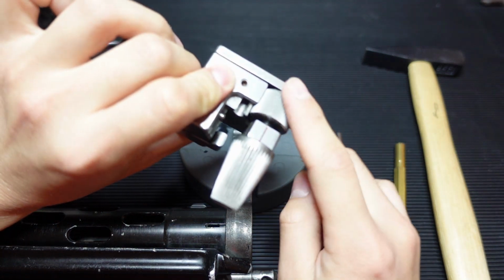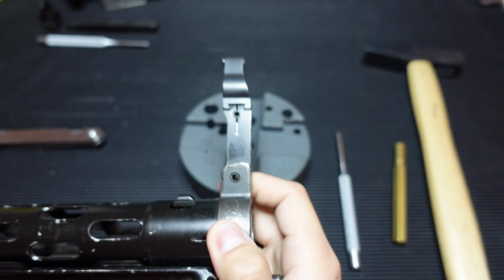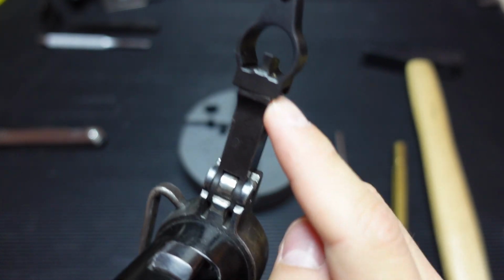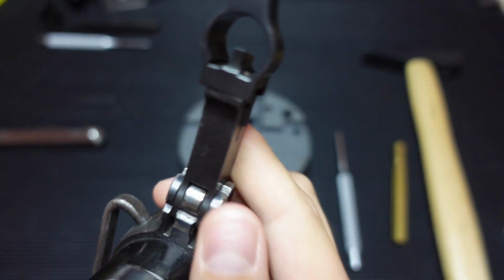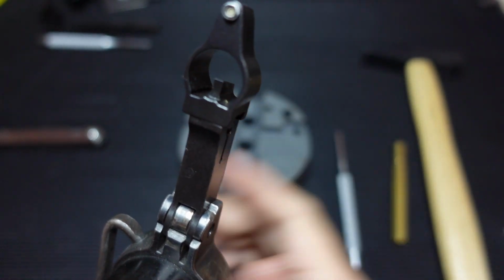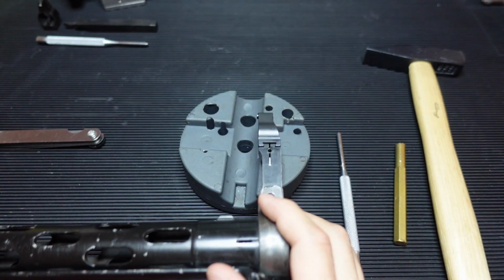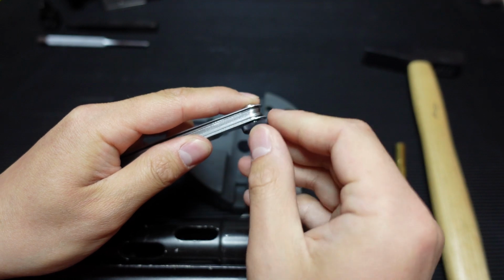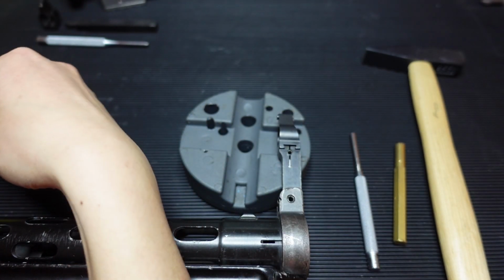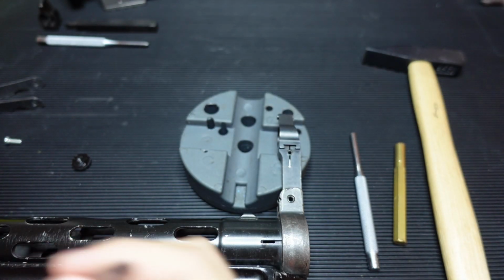So to replace the micrometer nut of the original armorer's tool, we're going to have to measure, basically choose a datum, which I would arbitrarily set to the right side of the sight base, measure that to this edge. And so when we replace or change out the front sight, we can easily re-register the sight into the correct position. So what I'm going to do is take apart the feeler gauge set and select basically a pair of gauges that suits this protrusion as much as possible.